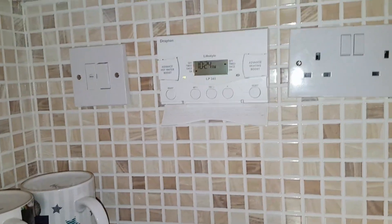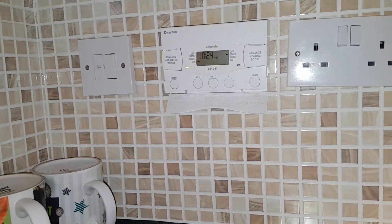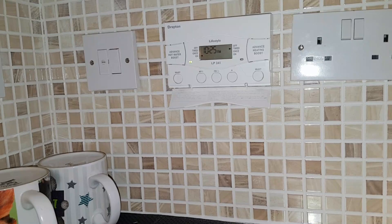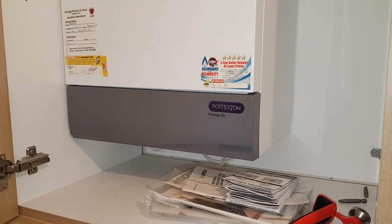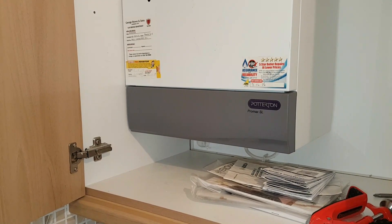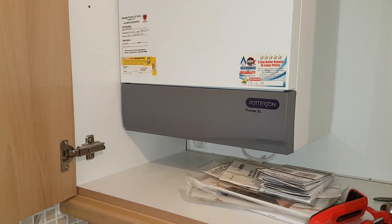On the Honeywell S plan we've got two zone valves — motorized valves — normally located in the airing cupboard. We're going to see the cylinder thermostat to check if that's activated, because that sends a signal to the zone valve for the hot water, which should in turn send a switch live back to the boiler to make it fire up. One reason it may not have done that is the hot water cylinder might already be up to temperature — if the cylinder thermostat is satisfied, that's why we're getting no activation at the boiler.